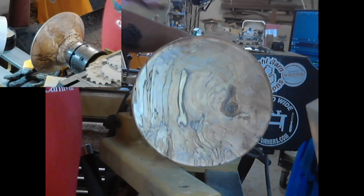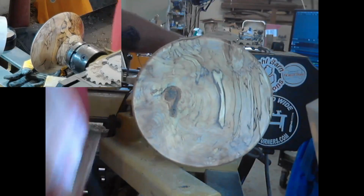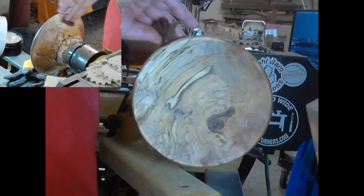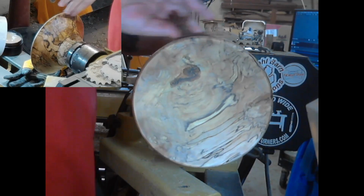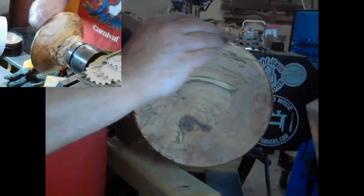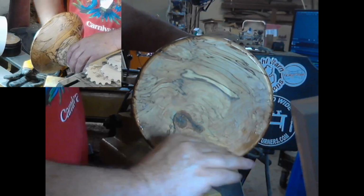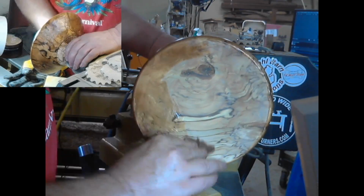So this morning, first thing, I sanded it back with 80 grit, and then I applied 2 coats of shellac sanding sealer, the 1 pound cut. Yeah, my famous mustard formula. Anyway, I did that, and then I added 2 coats of regular shellac, and then I cut it back with 120 grit sandpaper. So I sanded everything through 120, 150, 220, and 240.